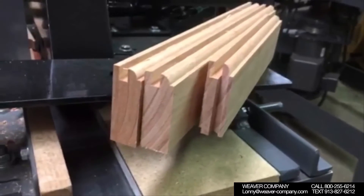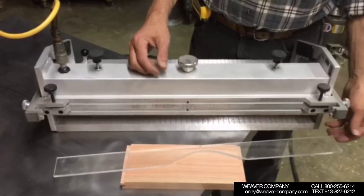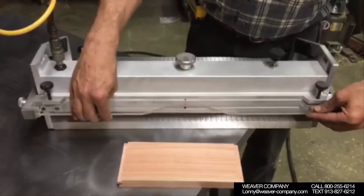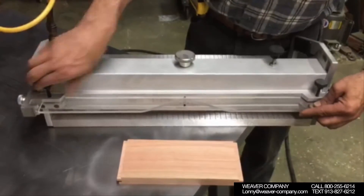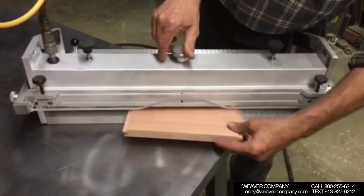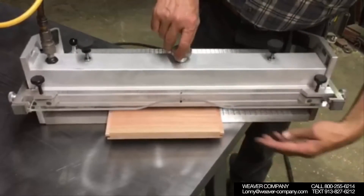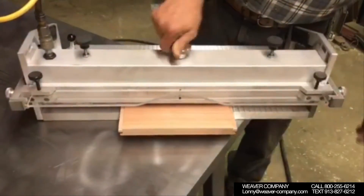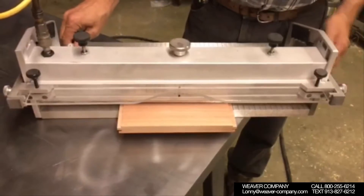So that would be what you would do for a square door. Now to do a crown door you also have to do the top crown rail, and for this we use our shaper master — one of two that come with the system. We have two big 24-inch shaper masters that are self-centering. These also float on air; air holds the wood piece down. And we're centering it to the pattern.